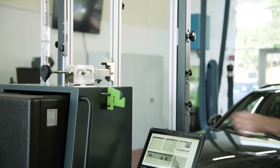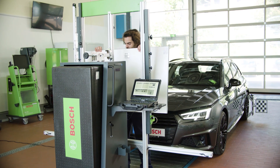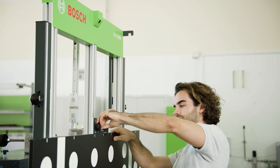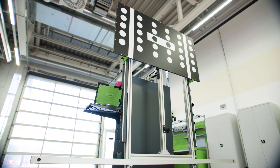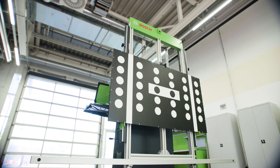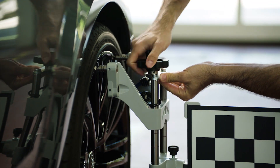As described in the setup information for the Audi A4, fit the two adapters marked 1 in position A and mount the dual-board calibration target. Center the target precisely after initial mounting. The dual-board can be mounted at various heights and thus covers all vehicle types of the Volkswagen Group, including large vans. Then, mount the universal wheel clamps and boards to the rear wheels.